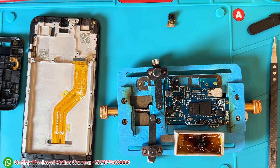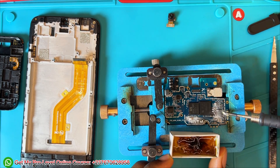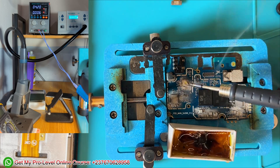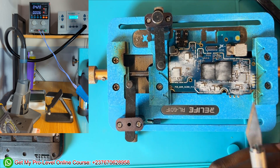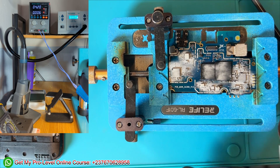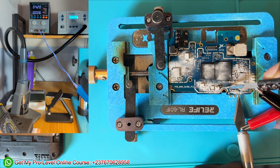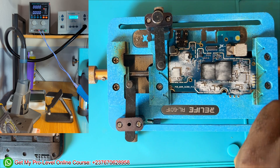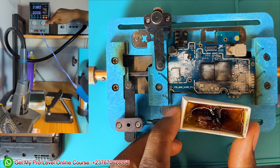I continued troubleshooting and used smoke powder — I had to spray it on the mobile PCB then use our DC power supply. Just watch how I do everything: I quickly spray this on the mobile PCB. My DC power supply comes in here; you can use a short killer — the reason I'm using my DC power supply is because it has an integrated short killer. I place the positive to the positive terminal and the black to GND.